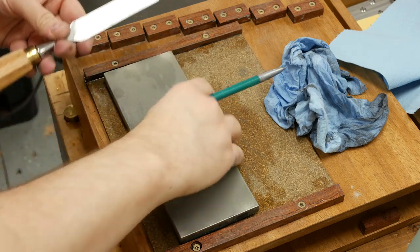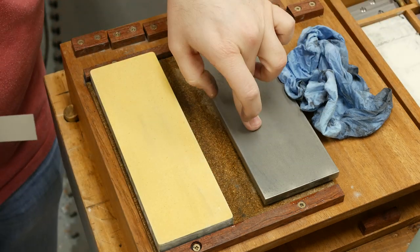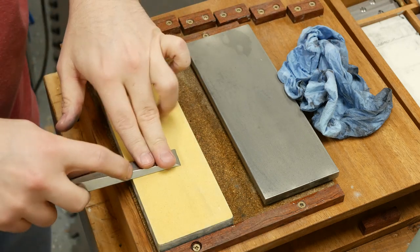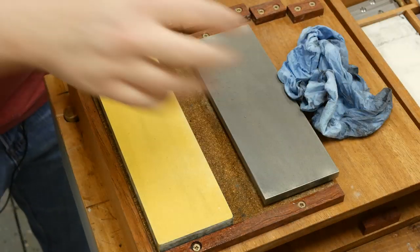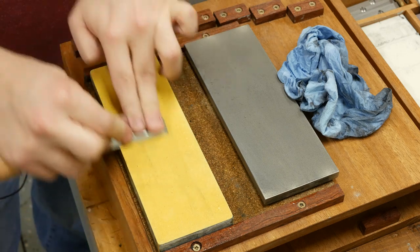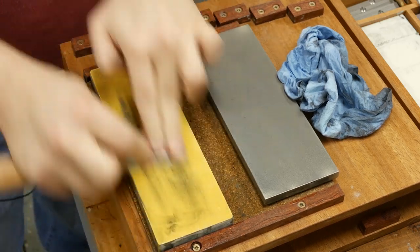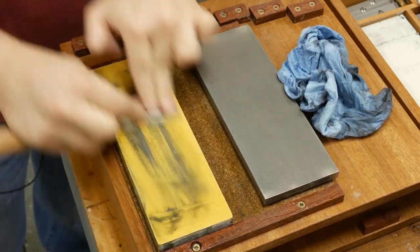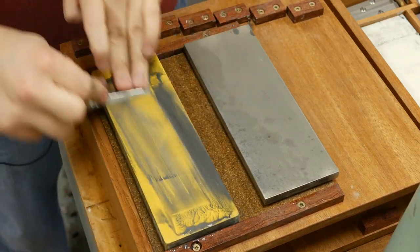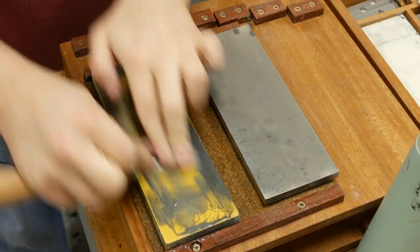With that done, I'm going to move on to my 1000 grit stone to replace the coarse scratch pattern, then keep moving up the grits. I'm going to do this the same way as the coarse — just place it on here, holding it the same way, putting as many fingers on it as I can and run it around a few times. You want to use the whole stone. After you do one side, rotate it and keep it wet to evenly wear the stone.